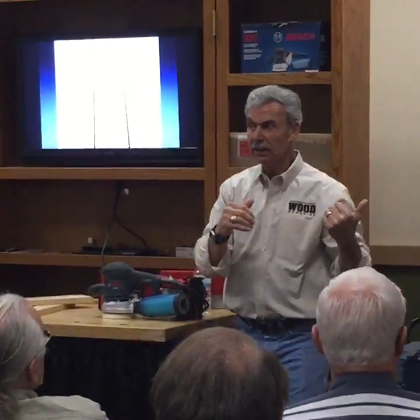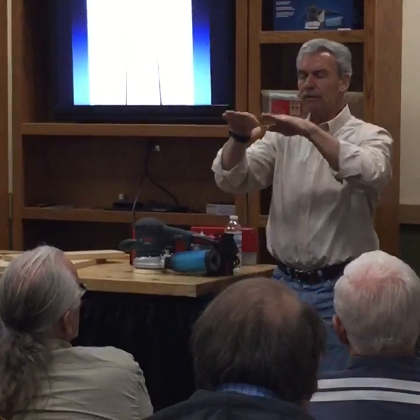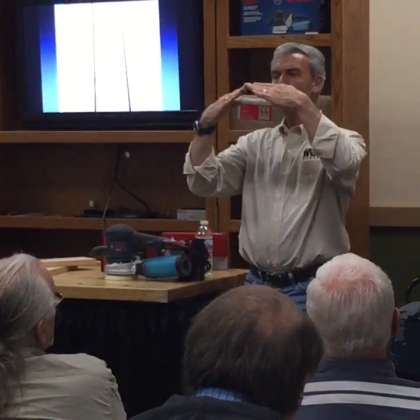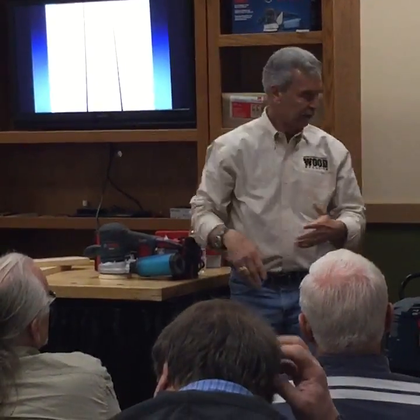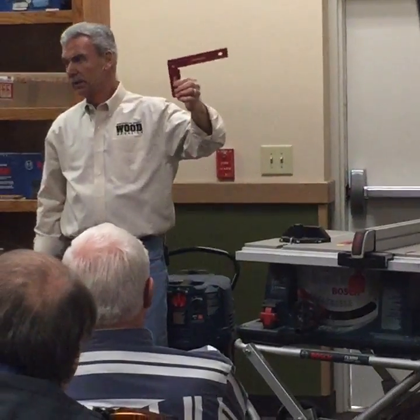And you think it's there. So now you join your boards through there, you cut boards through there, and when you lay them together to glue them, you'll find that the top edges meet, but the bottoms are away just a hair. And as soon as you put pressure on them, you close that opening, which means your glued up thing starts to rise. So the difference is, if you've ever taken it off 90 degrees, put it back up there and put a square back up to check it.